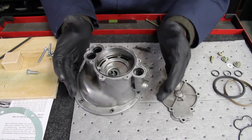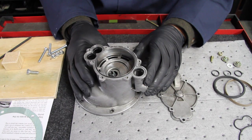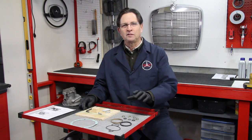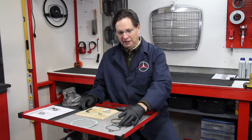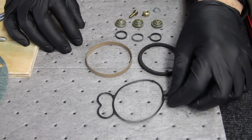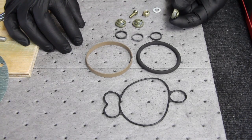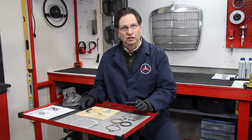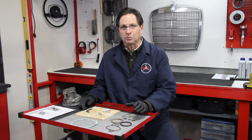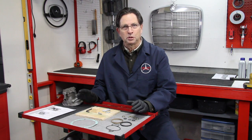To replace these items will require removing this pump from the engine. The heart of my kit are the internal replacement parts that come directly from Mercedes-Benz. These are OE parts and they include a new cap seal, the new piston parts, as well as three new check valves and the seals for these check valves. This kit does not include the external check valve — I need to make that very clear, because sometimes the problem could be this valve and it's only available to purchase separately.